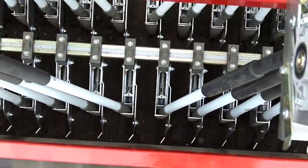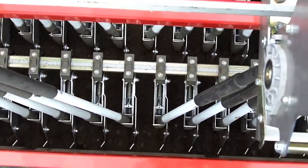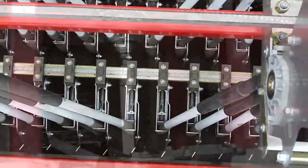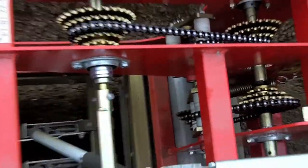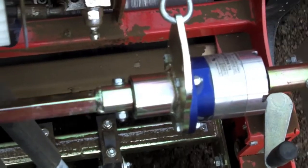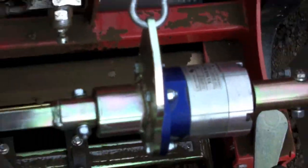Note the soil openers have spring tension for adjusting the required down pressure. The many sprocket combinations are to facilitate the desired seeds per acre. Also included is a 4-to-1 gear reduction to maximize seed distribution on high-density seed counts, like arugula.